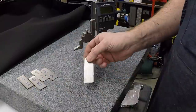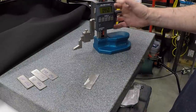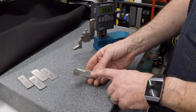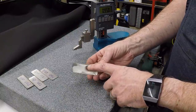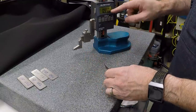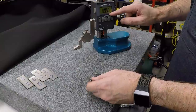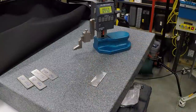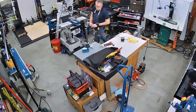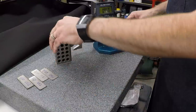Now we need to calibrate the bend parameters for this. So I had this set up so that with the bend parameters that I have in on the part right now, which is, I believe, the bend set to the radius same as the thickness of the piece, it calculates that if I want to bend up the 1-inch tab, the score line needs to be at 950. So we'll go ahead and make a score at 950.